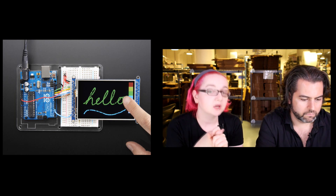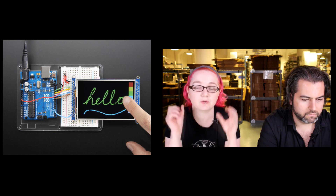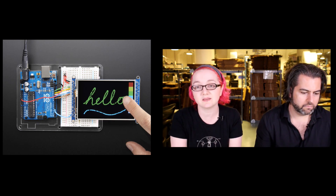You can use it with low-RAM microcontrollers like the Arduino without buffering and syncing the display, which is quite nice. But that means it's a little bit slower. It also comes with two interfaces — you have a choice. You can have SPI which uses only four or five pins, or you can use 8-bit which requires 12 or 13 pins but is much faster because you're writing 8 bits at a time. If you have the pins, go with 8-bit. If speed doesn't matter as much, go with SPI.